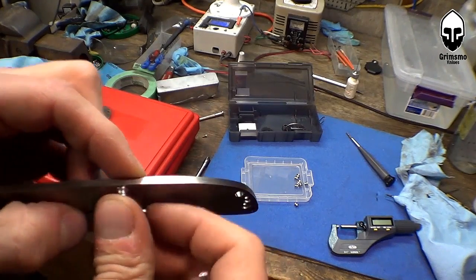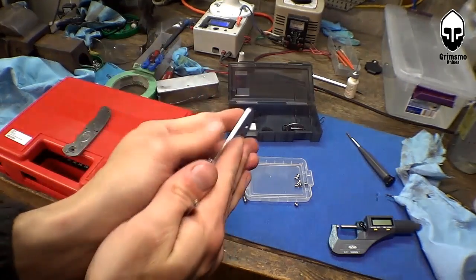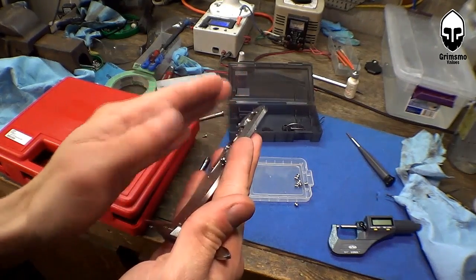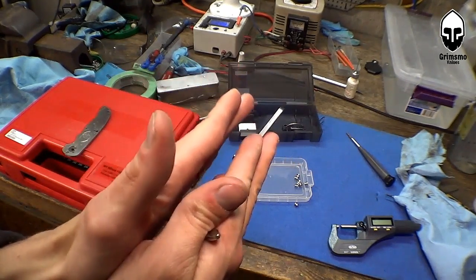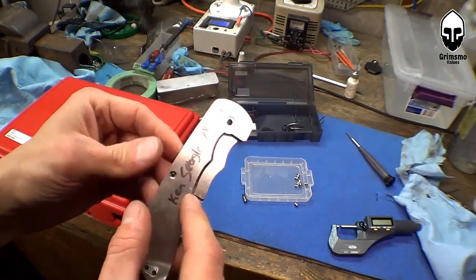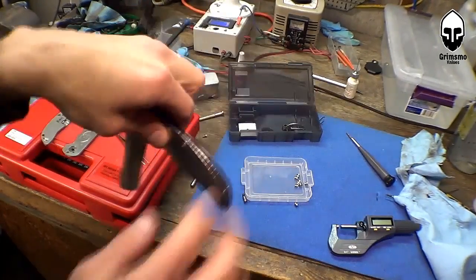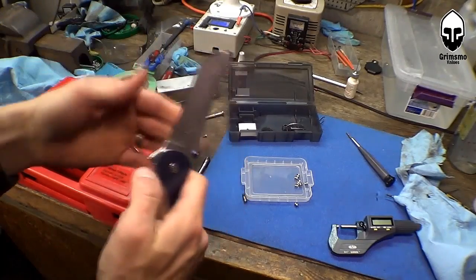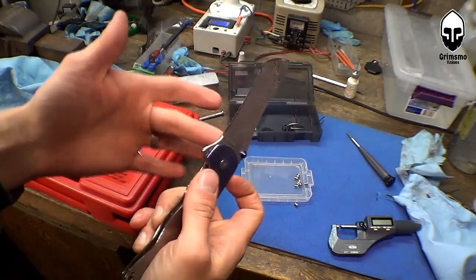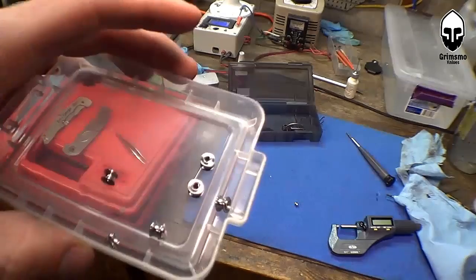Having shouldered spacers like this instead of just a back spacer keeps the handles in line from sliding — not that they slide much in action, but you want the knife to go together exactly like you made it, exactly like you designed it. That way everything is in line and everything works perfectly, and that's how you get knives that are so smooth the blade just drops. Not a lot of knives do that, and the pivot is tight with no blade play. Okay, so that wraps up our spacer video.